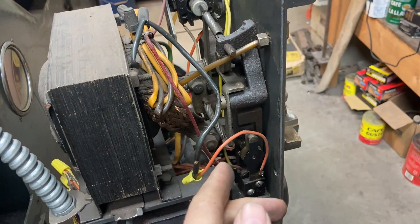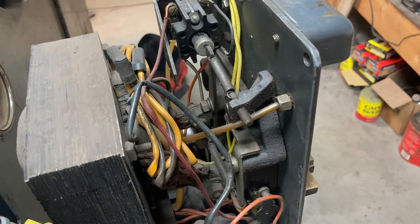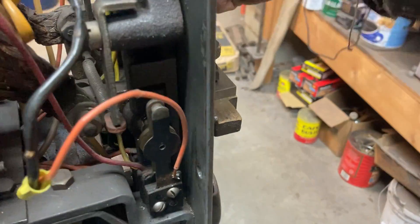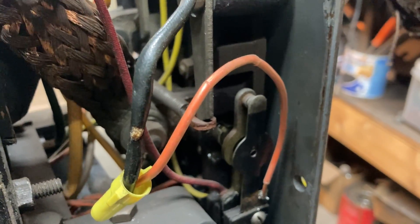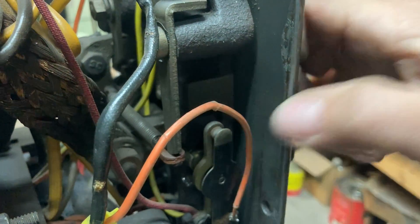I'll give you the rundown of what mine needed, and if yours needs something different, read the manual — you'll probably find it in there. So we're going to actuate the lever here and see the jaw move a little bit. The manual says you see this little leaf spring contact switch there — it should open every time I actuate that weld lever. Well, mine wasn't opening every time. That's because the little slide rod that the whole assembly is mounted on was hanging up because it was gunked up with decades-old grease or corrosion. So I oiled that and got it moving more freely so that the switch would open every time.